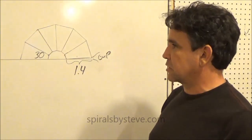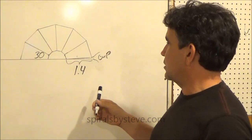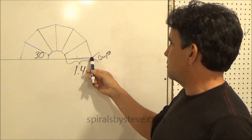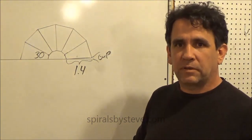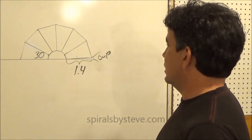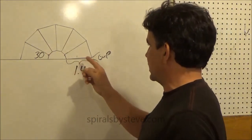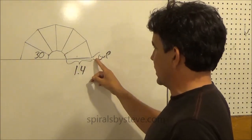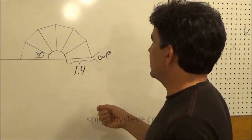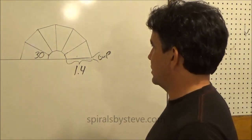The way I'm going to do this is cut enough segments to make half of a circle — half of a ring. And when I glue them together, it will make a gap that corresponds to the adjustment I need to make to make it perfect. So after I put these together, I'll measure this gap with a feeler gauge. I also need to know the width of the joint and the number of segments, which in this case will be 6, since they're each 30 degrees.